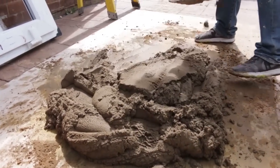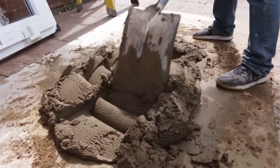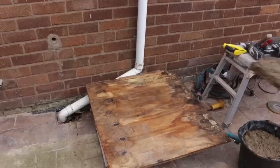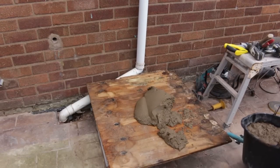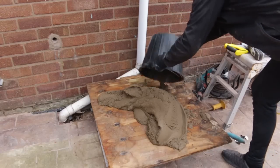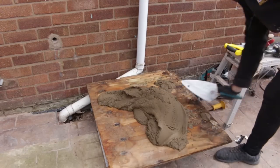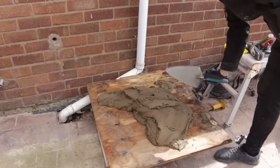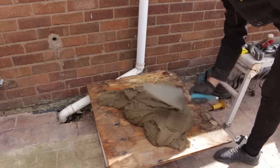Nice mix — we've got two and a half bags of sand and just shy of half a bag of cement. This is a half bag mix, so it's not a big part. I'll take a little bit of a bag of clay — actually, I'm not going to use that bag.